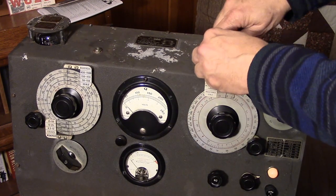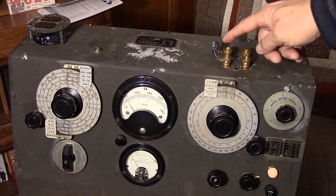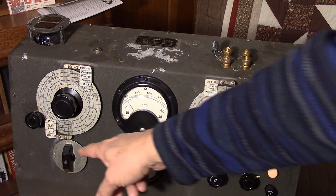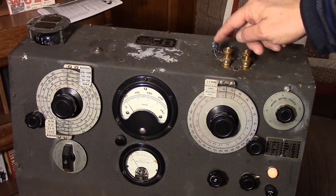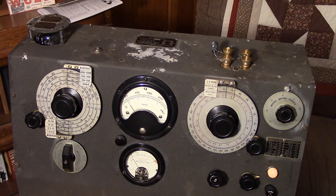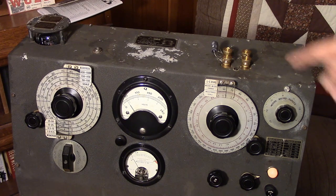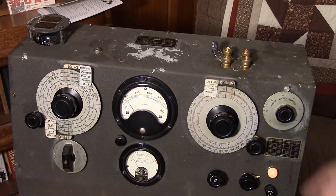We can try another coil. I've put a larger coil on here, so I've dropped down to the 2.5 megahertz frequency, which is one band lower. Set this for 2.5, and it's reading about 52, and this is marked 470. So I imagine this is a 47 microhenry choke, and this is reading 52. The Q is very low on this particular unit — it's a ferrite-loaded coil of some kind. You're not getting the kind of Q that you would on an air inductor or even a toroid; this is probably made for broadband power-type filtering.